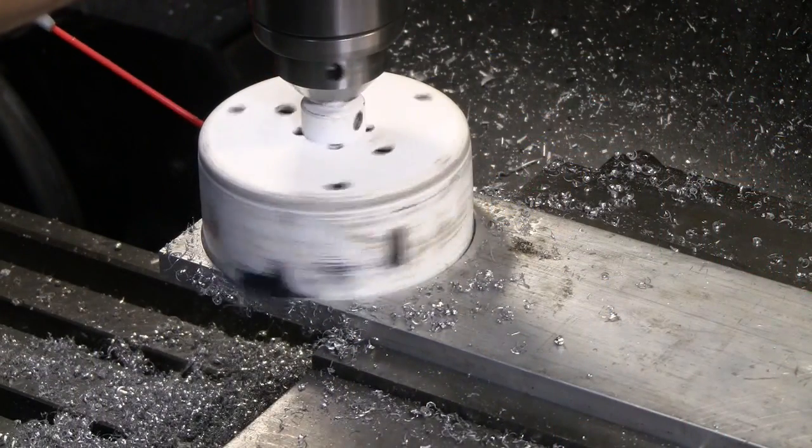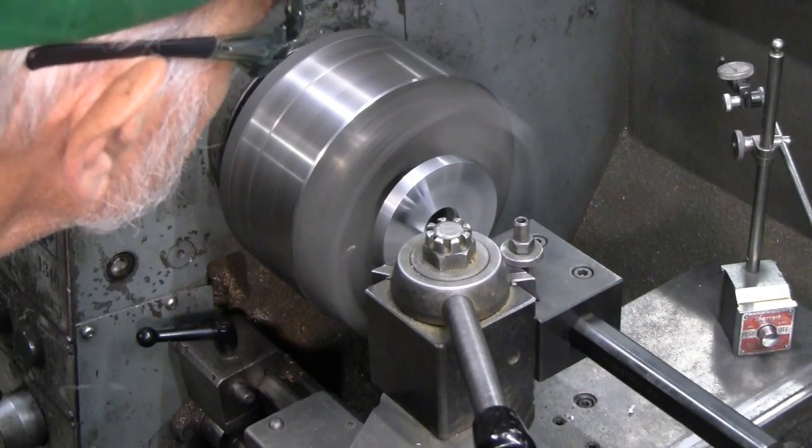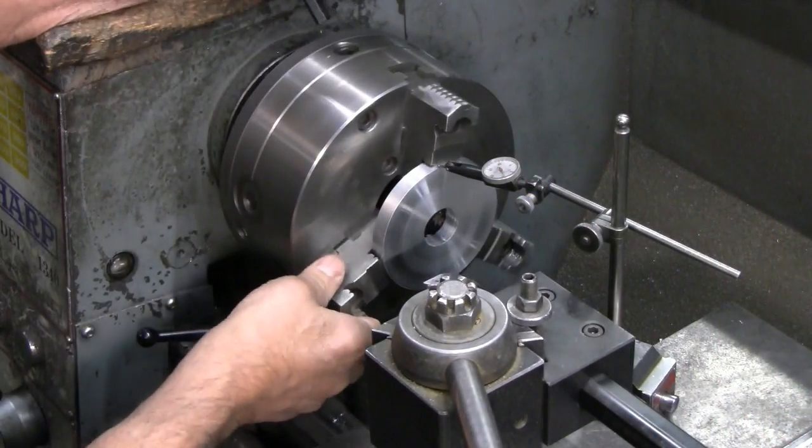Here's my take on the Kinetic Precision ring. I cut myself a four-inch round of half-inch aluminum bar, faced it, bored it out to inch and a quarter, then counter-bored one side about 7/16 of an inch deep to leave a web of about 1/16. I faced the other side, being careful all the way through to keep the work trued up, using my set-true three-jaw chuck repeatedly to adjust the runout.